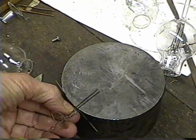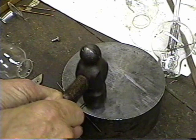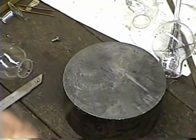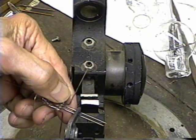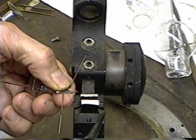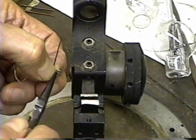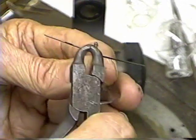We'll just put them against this piece of steel bar here and tap them. Now we just have a little flat side on those wires so when we pinch it over onto the filament wire, we'll have more surface area touching. Go ahead and trim these off to maybe about a half inch, and then we're going to bend each one to put a little loop in it so that we can have something to pinch down onto the filament wire. Be very careful here — I don't want to break the glass. We just have a little loop there that we can slip the thing in, and we'll use the mashers to just squish it down and hold the wire.